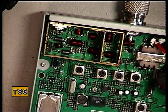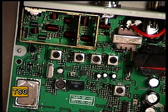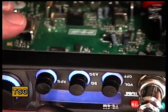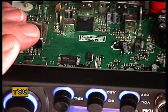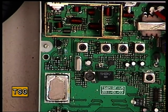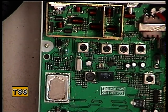There we are, receiving virtually off the clock on my test instrument. The S meter adjustment doesn't appear to be adjustable — it's showing S9 plus 30. It must be set like that at the factory; I certainly can't spot it on the photocopied circuit diagram we've got.